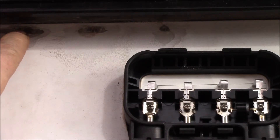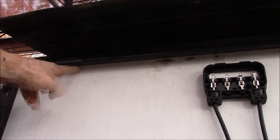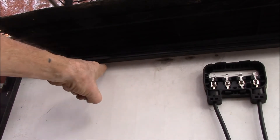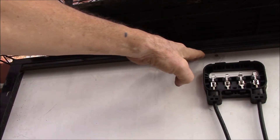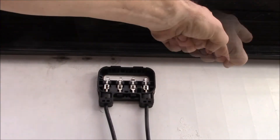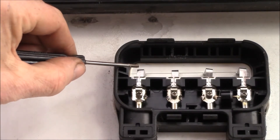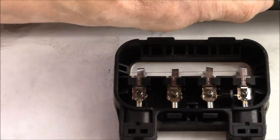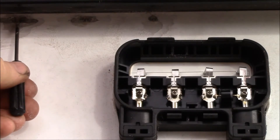I don't know if you can see that — it's kind of up in the shadow the way the panels are built. Let me show you first. On the panels there's a bus bar on this first row of cells that goes down, then comes up. All the cells are in series, and then there's a double bus bar that connects the top of this column to the next column of cells. That goes down and over, comes up, there's another double bus bar, then it goes down and comes back up to the final connection. So you have these tabs — this is the most negative, and this connection here is to this bus bar, this connection here is to the bus bar right there, and then this is the most positive bus bar.